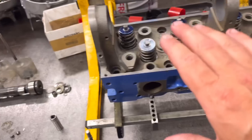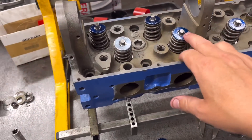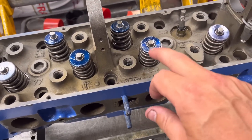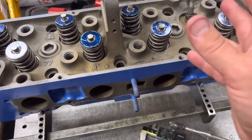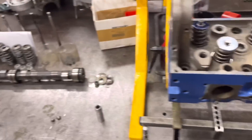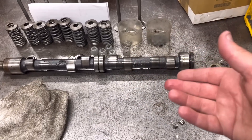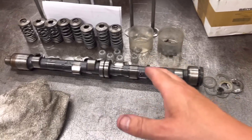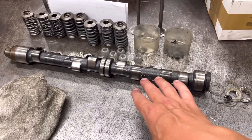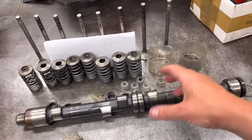So we've got the cylinder head here. Now these are the old valve springs — they're a double spring uprated. You can see the spring caps are anodized; obviously where people have took the collets out it's scored up here, but they're not damaged at all — they just look a little bit scruffy, but the customer wants to use those. The existing cam is sort of the fast road rally cam, the one up from a fast road cam basically. And there's about seven and a half mil of cam lift on this, which equates to about 11 and a half mil of valve lift, if you take into consideration the rockers and the ratio there.